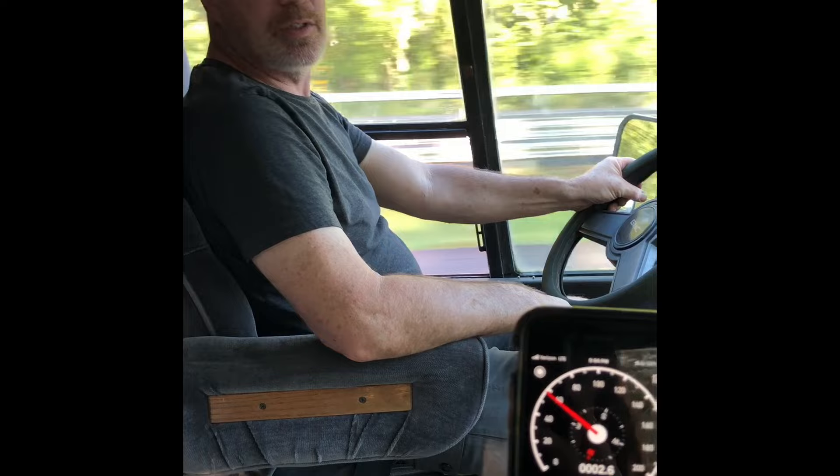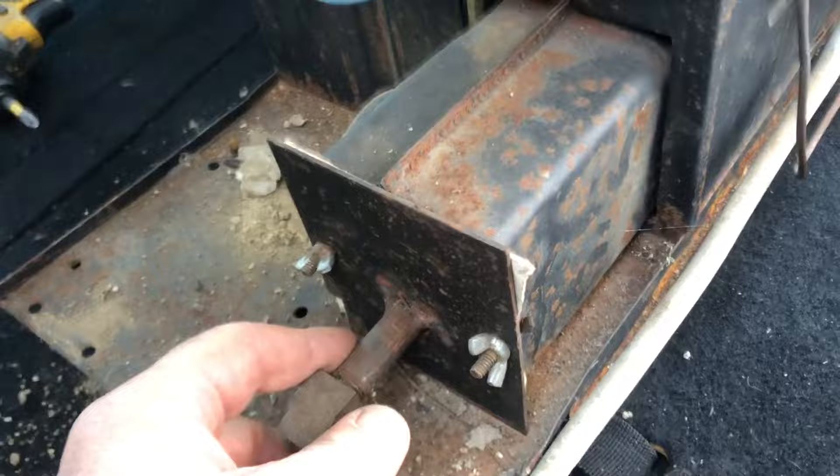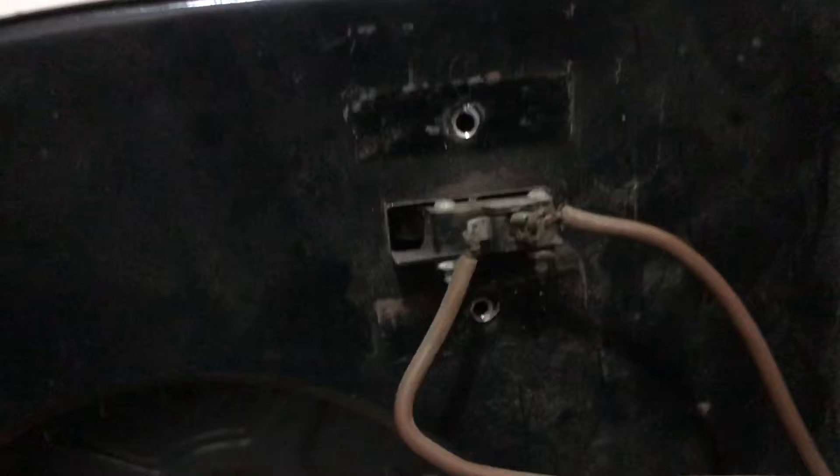The clanging is all this stuff in here — there's a wasp butt sticking out of there, this was all filled with mud dauber nest. We're just going to vacuum this out and clean in there. These wires are just twisted on here, so we're going to solder them so we don't have any arcing. Those are soldered on. They got a bit hot so I wanted to make sure this is still working — it does. That's my fan switch, so that's good.